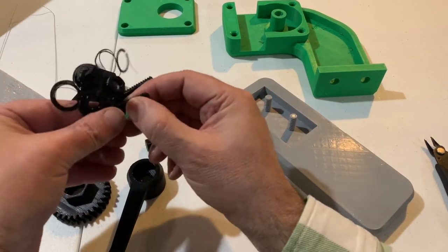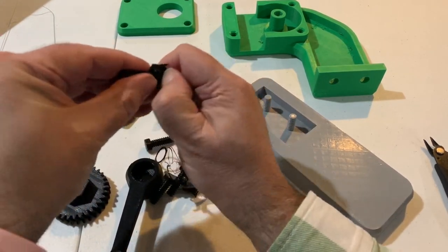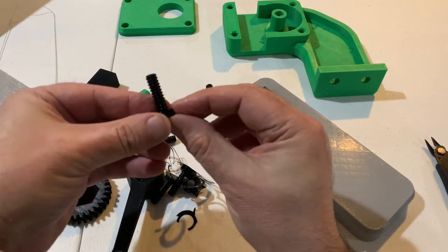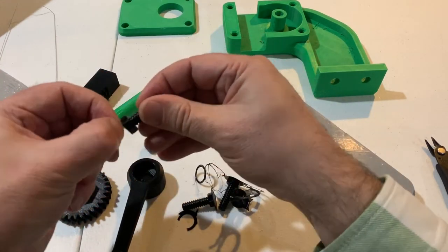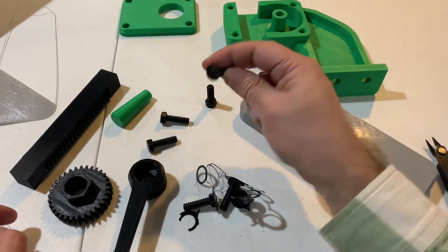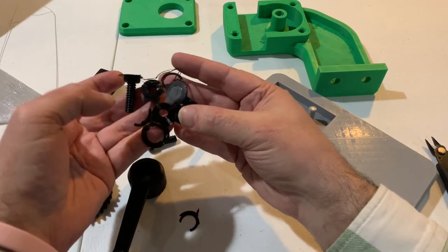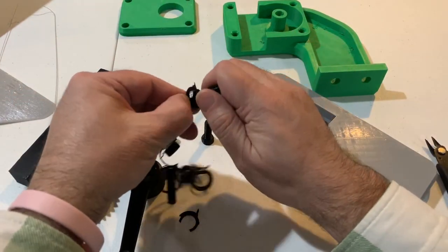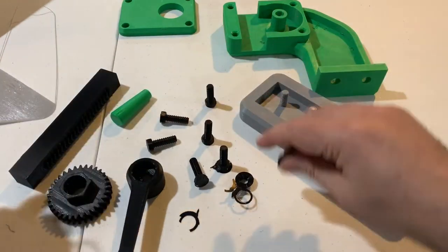Back to the assembly. Some of the parts here — I haven't even taken the material off. This is the brim, which I thought was necessary for these parts because they had way too little surface area for contact with the print bed. I had a couple of issues where when you have something like that and you're printing on top, they start moving and come loose. Having that brim on there made them all share the same surface area, which helped a lot. So let's get that off of there and clean these up as we go.